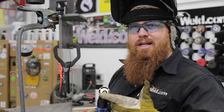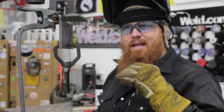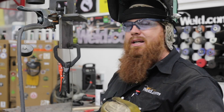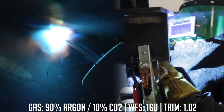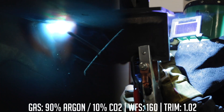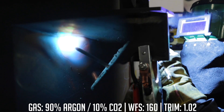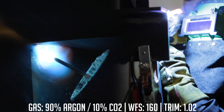We're going to maintain that three-quarter inch to one inch contact tip to work distance — anywhere in that half-inch to one-inch realm is going to be pretty decent. Remember, you want to hear that harsh buzz sound. If you're getting crackling, that means you're getting too close and need to pull back a little, or you could adjust your trim. Trim values above 1.00 give you a longer arc length and a more fluid puddle. If you need a stiffer puddle — like in vertical — drop the trim below 1.00. I usually bump trim by one-hundredths, going from 1.00 to 1.01 or 1.02 for a more fluid puddle, or down to 0.99 or 0.98 to stiffen it up.